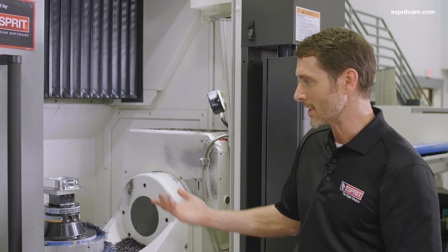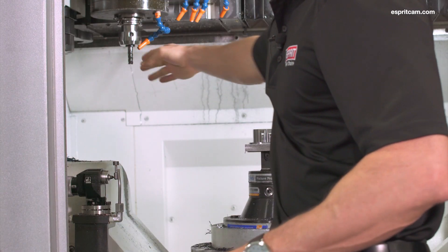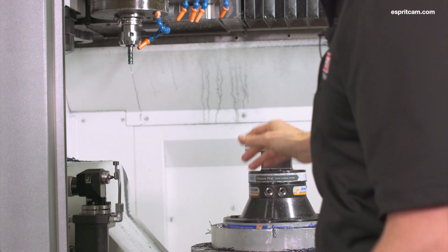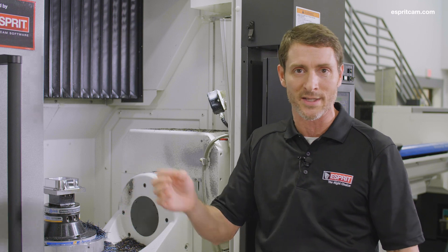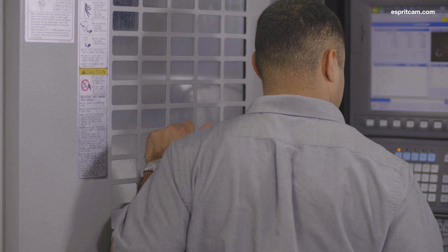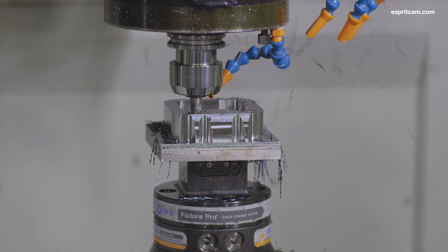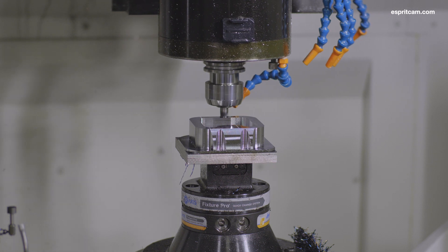After doing that type of aggressive cutting you would expect the part and the tool to be very hot, but as you can see I can touch both the tool and the part and they're not hot at all — the reason being that the heat is actually evacuated in the chip. If you're not using this cycle I really would recommend that you try it. The benefits have been proven, there's no special licensing or add-ins required, it's available in all of Esprit's rough machining cycles as a strategy, and we develop and maintain our own algorithms for this cycle better than anybody in the industry.